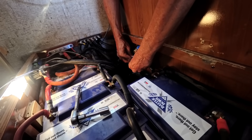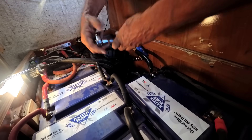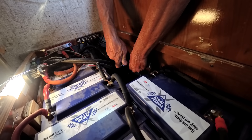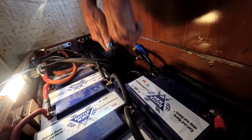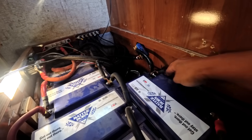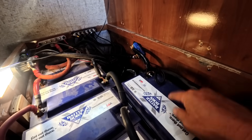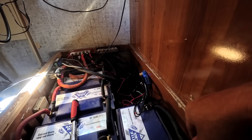Jeff, you have to be careful — it's still considered live. Remember, it's battery-on-battery. That's why if you didn't want the spark, we could probably just unhook the positive. But it's done. It's only a 12-volt system. There's one wire that goes to the positive, which is the red one. He just tightened that, and the light is blinking, so we're good to go.